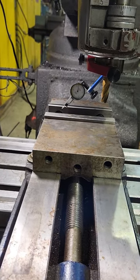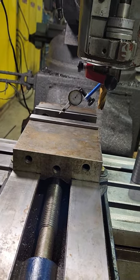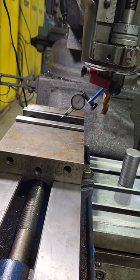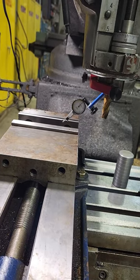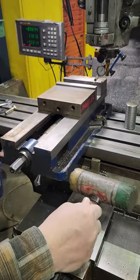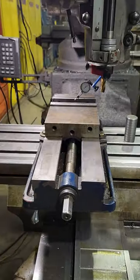So I know I need to tap on this side of the vise and bring it back to zero. As I go along I can just keep bringing it back to zero. You can do this a couple of times across here and it will get it dead on. I went a little over, but you will get pretty close just from the start.